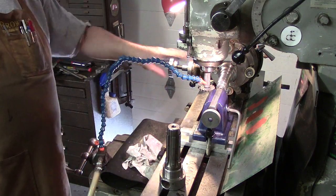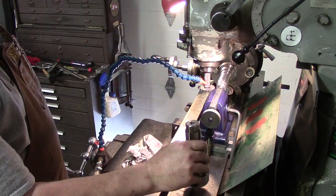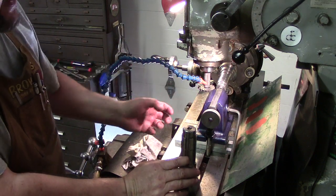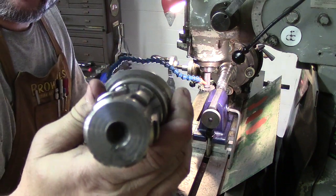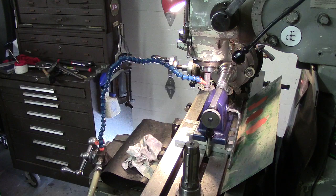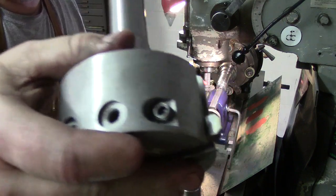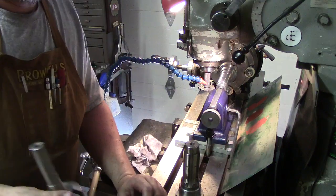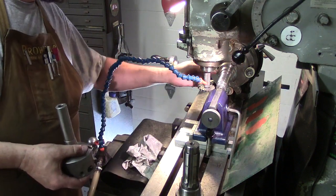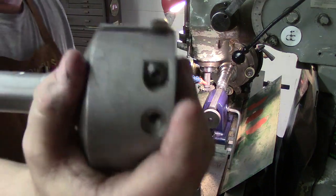We've already made one pass to make sure we had everything the way we want it - our depth and everything. Each of these grooves is approximately 100 thousandths depth of cut. What I'm doing is going in first with just a basic slot cutter - like a keyway. Even though this isn't a square, it's got a bit of a taper on it. I'm going to go back because I tried doing it to begin with and it wasn't cutting like I wanted it to - this material is pretty hard. I've already shaped my bit in my big fly cutter. We're going to come in here and cut it first because this has a carbide tip.